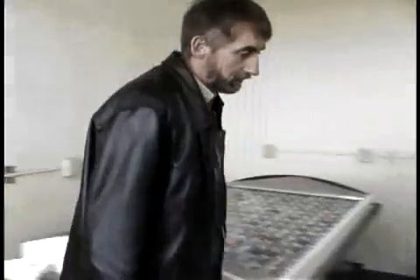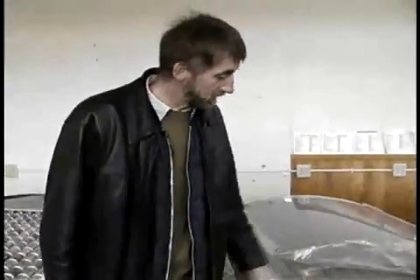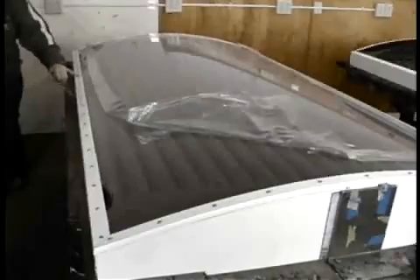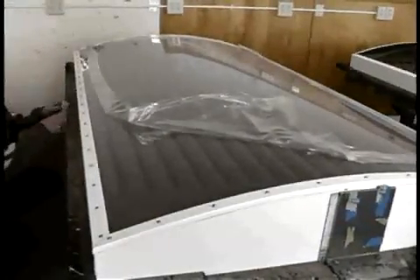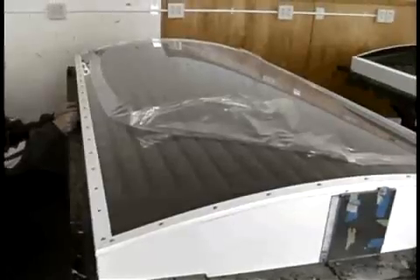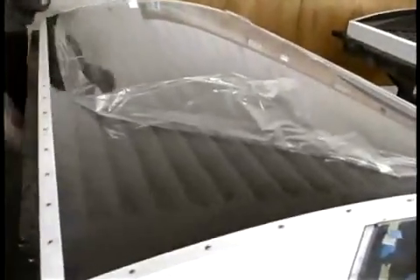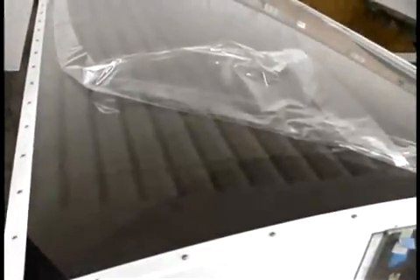The panels are basically made out of powder-coated galvalume and UV-stabilized polycarbonate, which is the lens area. The sun shines through this clear lens and hits the black aluminum. We have 240 pop cans modified in such a way as to cause the air to spin through them, so centrifugal force comes into play and it separates the relatively heavier, colder air out of the rising column of air.